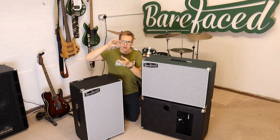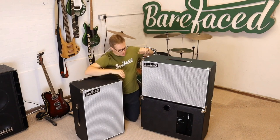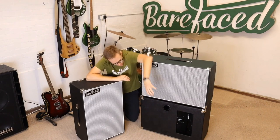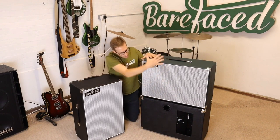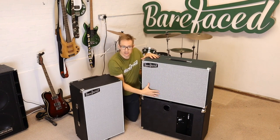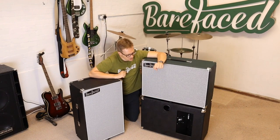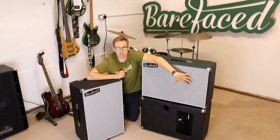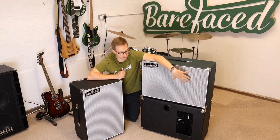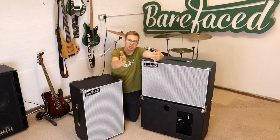And the wall reflections, they aren't so closely stacked, whilst floor and ceiling reflections all happen at very similar frequencies. So on this Radical cab, it's designed so that only one of the speakers is running truly full range to give us wide dispersion, like a line array. We call that our barefaced line array crossover. And the other speaker is putting out plenty of sound, but it's not putting out the treble frequencies at which it would conflict with this speaker and narrow the dispersion pattern.